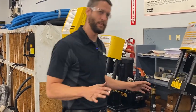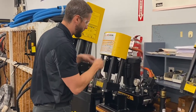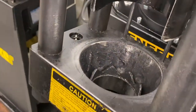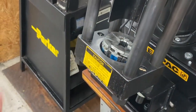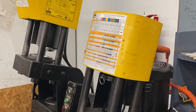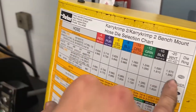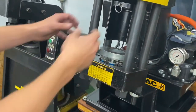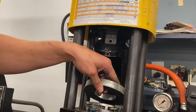If you're ever not sure it's enough, throw a little extra lube in there. Place the die in the crimper and make sure it's all even — it goes into all the grooves, kind of like little triangles — so you want to make sure they fit in there nice and evenly. Prior to crimping, you want to make sure you select the correct die ring. We have two options: a black or a silver die ring, meant for different types of hoses. The chart tells you everything — for 471 TC, come over to silver die ring. Parker also allows you to move the pusher back for long 90s or bigger fittings, and you can split it to come up through there.